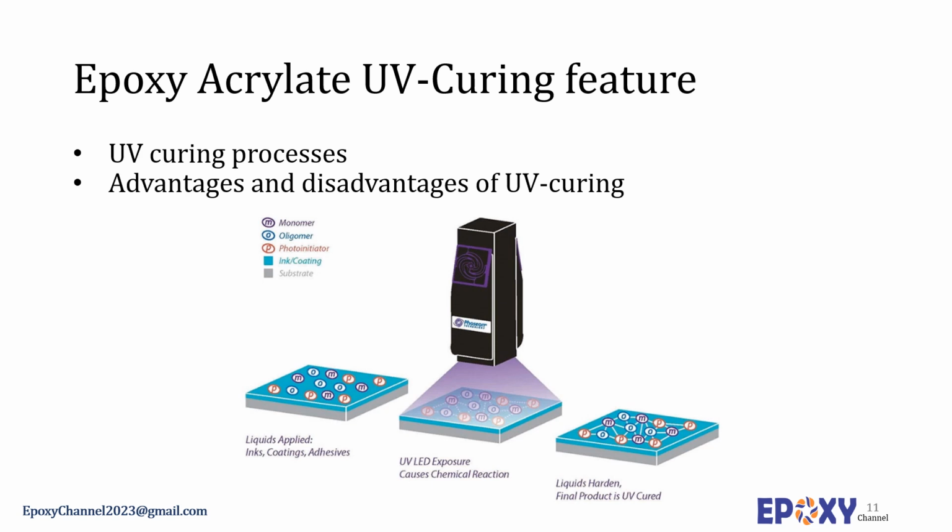Although both the methacrylate and acrylate vinyl ester resins have been employed in radiation cure application, the use of the latter is preferred in UV cured coating and ink formulation because they are faster. In many UV applications, the cure is completed within 0.1 second. Electron beams and other radiation sources have also been used to cure vinyl ester resins. The major advantages of radiation cure as compared to thermal cure include greater energy efficiency, reduction or elimination of volatile emissions, faster line speeds, ambient temperature cure, low equipment cost, and low floor space requirements.